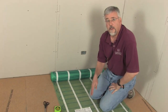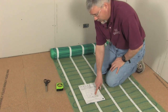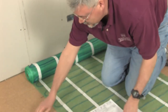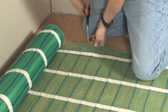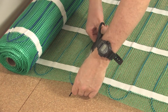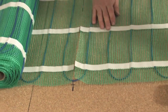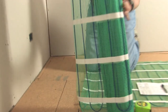On the plan you will see measurements given — 14 feet, 12 feet, 11 feet — whatever that is. That is the actual footage of the green mesh. This panel has been made 14 feet 6 inches in length. I've made my measurement and marked it right here. At this point we take our scissors and cut the mesh. Once again, never ever cut the wire. We cut right on the mark made on the floor. When I get to the end of the loop, I'm very careful to separate the loop from the mesh. Now we've separated this area — this is 14 feet 6 inches for this length. We take the roll and flip it over.